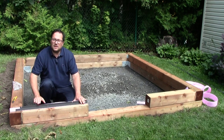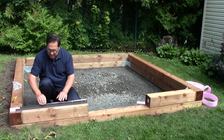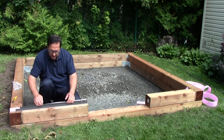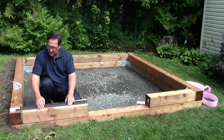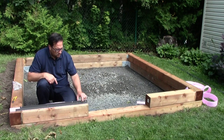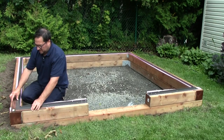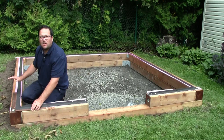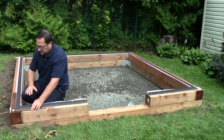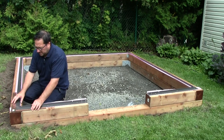Another thing is to make sure to put the base on the right side of the greenhouse. As you can see, the corner goes to the inside and the outside is the open space of the base. Otherwise, you're going to have trouble figuring out how it fits. Also make sure you have the two holes just next to the position of the door. While fixing your base, you may want to check before fastening all the screws that your square is perfect — not too much difference in the four corners.